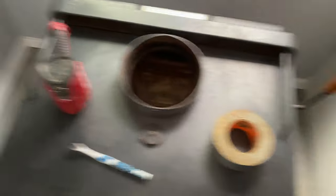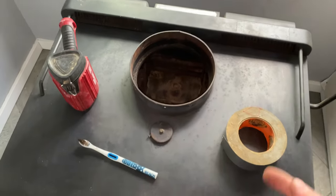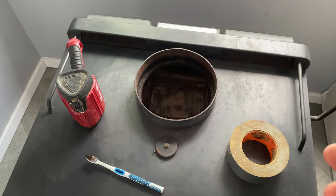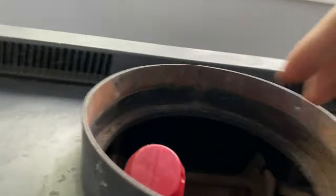Next, we're going to put the chimney back on, but make sure you take a chimney broom and clean that out before you put it back on, because material will fall back down into your combustor again. Keep everything clean. One more tip: if you have a smartphone, stick a flashlight on the back side and as you move it around you can see the light passing through all the combs — that's when you know your cleaning job is done.